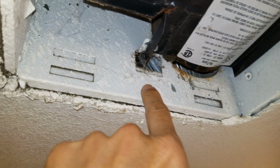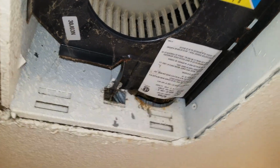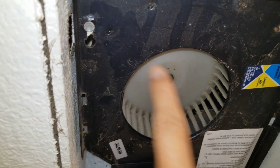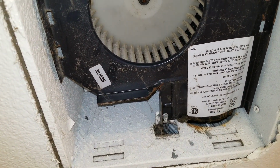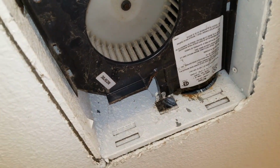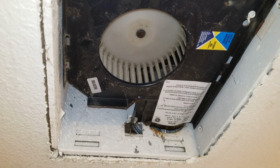So I can see the exhaust tube is right there, and it's mounted by these 2 screws. So yeah, I'll need to remove this 1, 2, 3. I think it also looks like a 1/4 inch socket. And after that, remove the fan, and then there's a plug right there to disengage. And I gotta see if there's enough room to mount this, because somehow this side is wider on the new exhaust fan that I got.